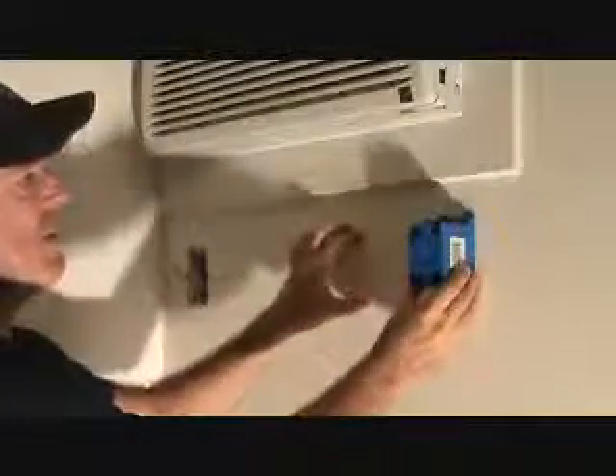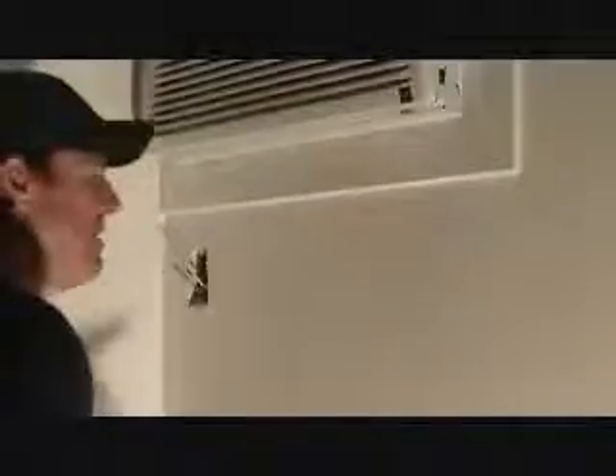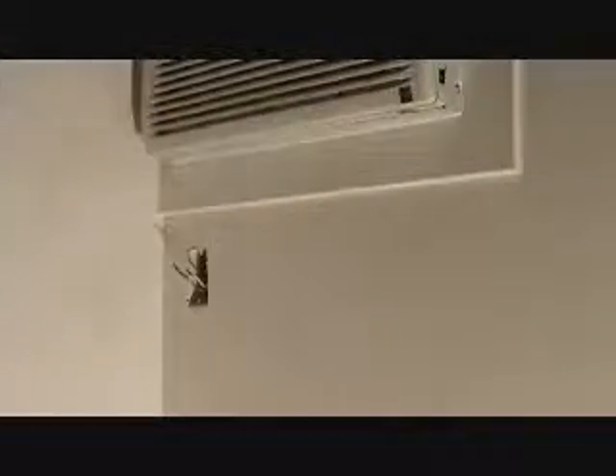This is the wide open area over here, which is closer for somebody to turn on the switch — you want that switch over here. If you've got the plug here and the switch over here, you've got the cord coming out of the air conditioner plugged in and you've got to reach around that or walk over. If the TV is too close, you can't do that. So you don't want to be reaching over to get the timer. In this case, because this is the wide open area, you want the timer then the plug. If this was reversed, you'd want the very opposite.